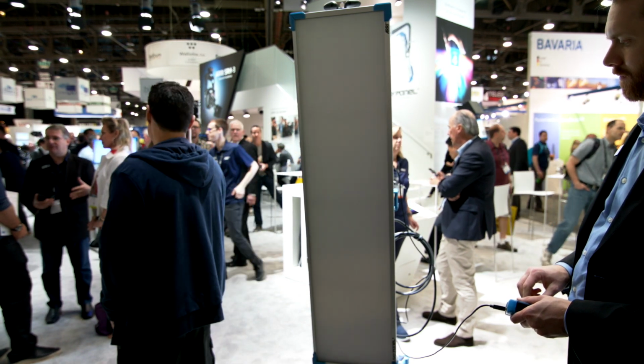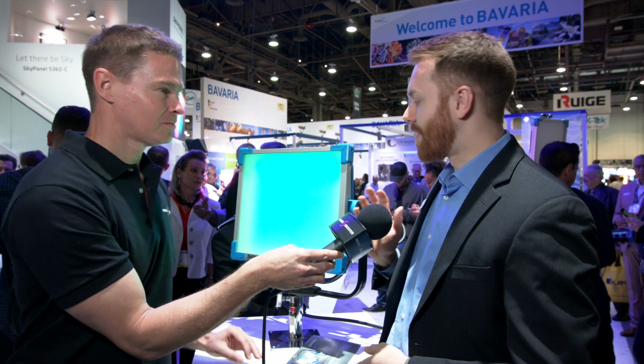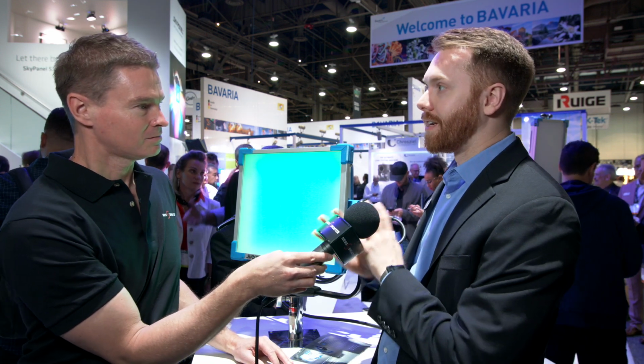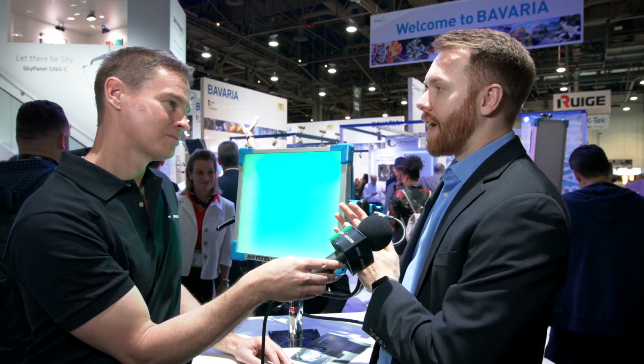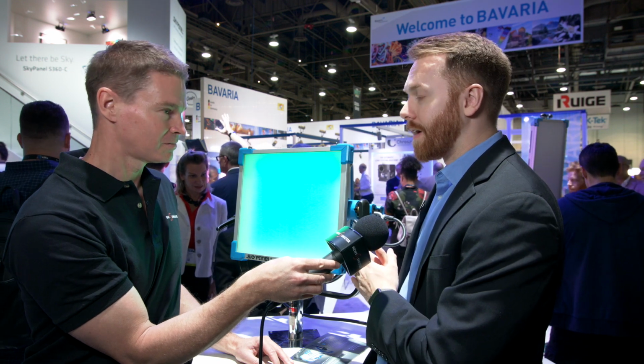And you can do that through 6 modes: 8-bit and 16-bit mode, CCT, RGBW, HSI, and XY coordinates. So that's going to be really great for people who want to dive in and have really fine-tuned control over it. We also, in 3.0, had lighting effects built into the SkyPanel, and now we're adding 4 additional lighting effects. We have explosion, so you could have a fast explosion, like a muzzle flash, or a slow one, more like a fireball.